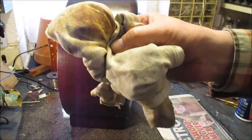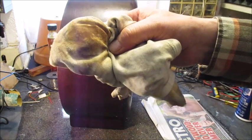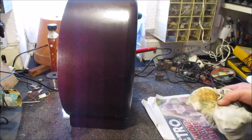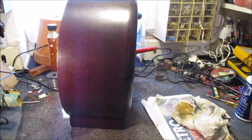You'll see the stain coming off onto the rag. You tend to get a feel when the Bakelite begins to develop a less dull luster. I usually apply stain remover 2 or 3 times, but do not spend too much time on this, as it is quite possible to adversely affect the surface of the Bakelite.